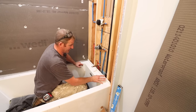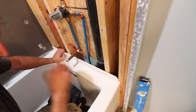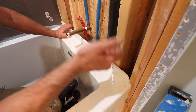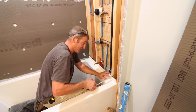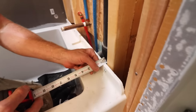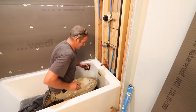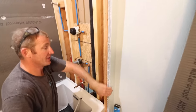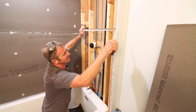The second way to achieve waterproofing around your tub flange is to simply run the board on top of the flange and fill in the tub gap. All backer boards need an eighth-inch spacing for expansion and contraction, and we're going to use a bead of sealant embedded on top of the flange. Make sure your flange is not thicker than your backer board — if it is, you may need to shim out the wall. This shows about a half inch, so the half-inch backer board will meet up with the top of the flange. Our width measurement here is thirty-three and a half inches.